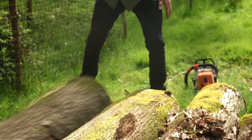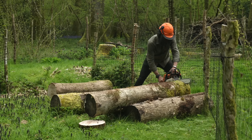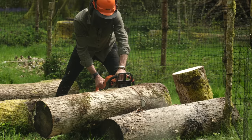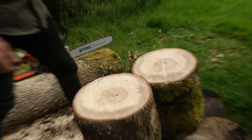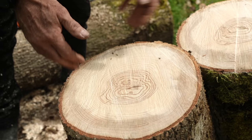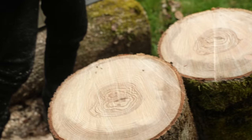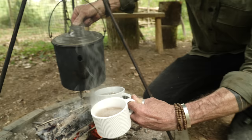That's not an ideal candidate for shingles. It wants to be as straight and as clean as possible, so we'll have a look at some of these lower logs - that's why these are left here because they weren't. This one might be a little bit problematic where there was a branch, but we'll try and split that off first. You can see the difference - there's no multiple knots, just a single heart there. It's quite an evenly grown tree, so when the center is roughly in the middle it means it's grown nicely on its own.